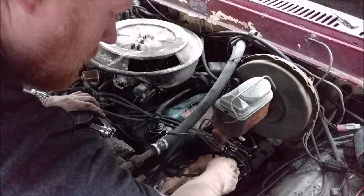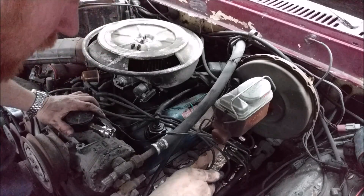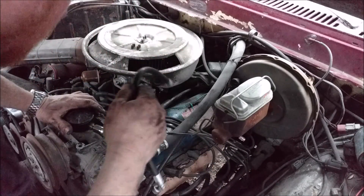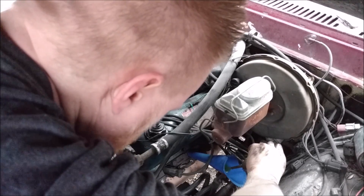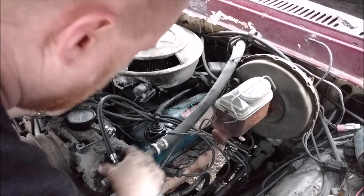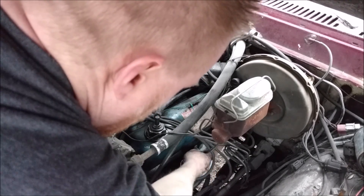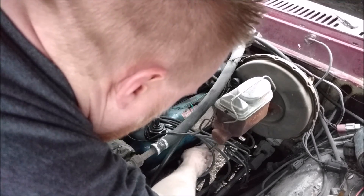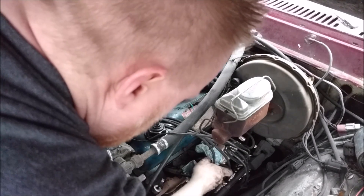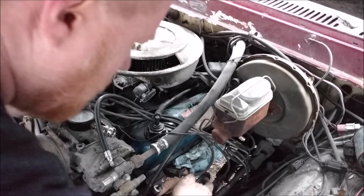There's a quick and easy way to determine whether it's your piston rings or your valves, and that is by pouring about a spoonful of oil down into the spark plug hole into the piston. Some will leak out, possibly onto the exhaust manifold. I'm going to catch some of it — I don't want to screw the gauge on yet because I want it to actually lubricate the system. I'll put a towel in this general area just to catch some oil and crank it over. You don't want to put enough oil in there to hydro-lock your engine.